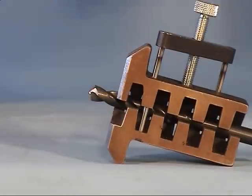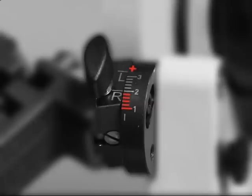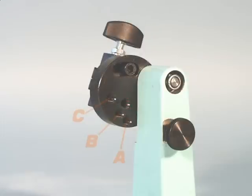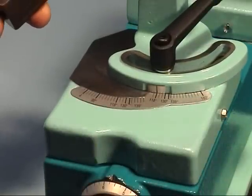Align the cutting edge in such a way that it is located in between the two adjusting lines. Set the clearance angle to 2 and lock the pivoting mechanism in position C. Adjust the upper angle scale to 155 degrees.